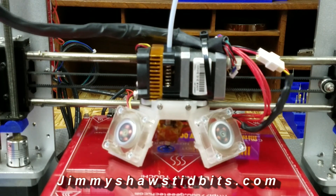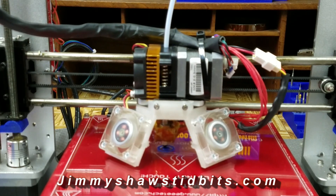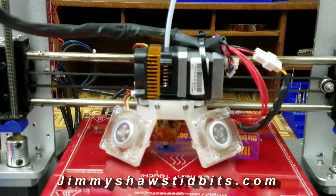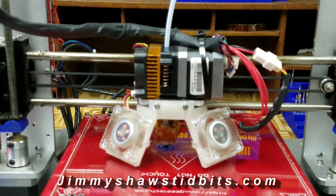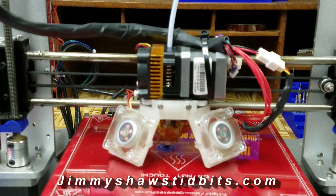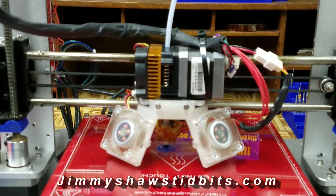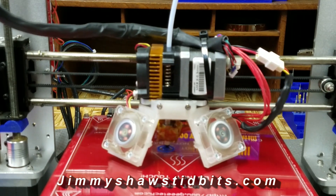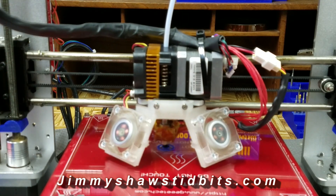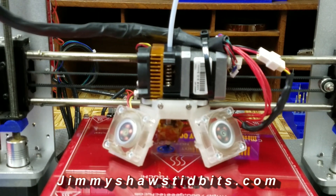In case you're fairly new to the channel, this is my GTech aluminum Prusa i3 — my very first printer. I picked it up back in February of 2016; it's the machine that got me started into 3D printing and YouTube altogether. I've done quite a few upgrades, including my anti-wobble brackets — I'll put a link in the description. It's the fastest, cheapest way to get rid of Z-wobble without buying new lead screws.